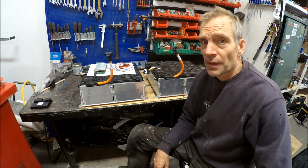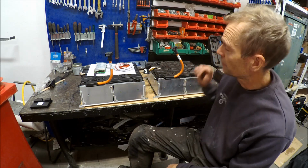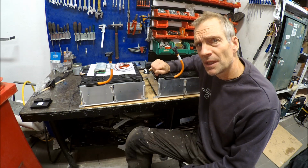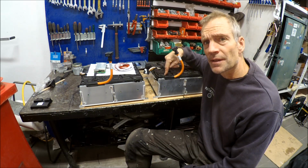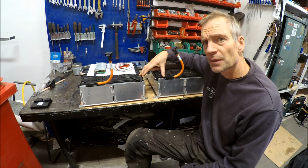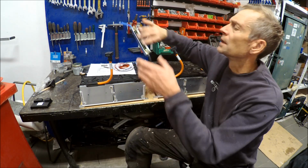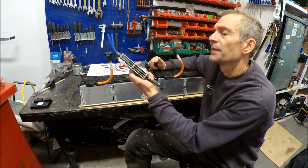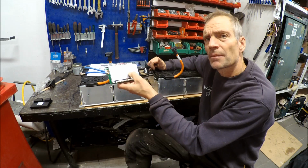Now it's time to prepare the battery pack for the electric rock roller, and I will use two battery modules from BMW i3, and they are 12S each. So I will connect two in series, and I will have 24S. And I will use a smart ANT 24S BMS. And this one is rated for 300 amps.